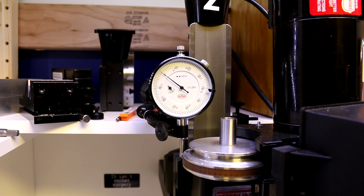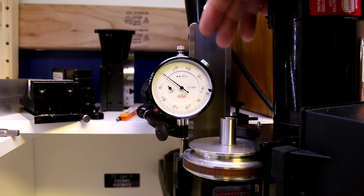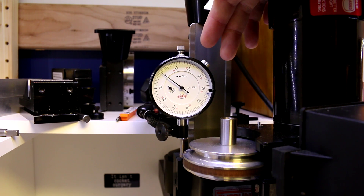My first thought is to put a DRO on there, but maybe you don't have the funds yet to do a DRO, or you're not ready to do the mounting for the DRO, and you want to have a direct reading. The DRO that comes from SureLine is a reading off the hand wheel, so it's not going to take into account the backlash. This will, and this is something that you may already have in your shop, so you don't have to spend any money on it. You can obviously do something a little bit fancier — it's still probably going to be cheaper than doing a high-end linear DRO, even from a company like iGaging.